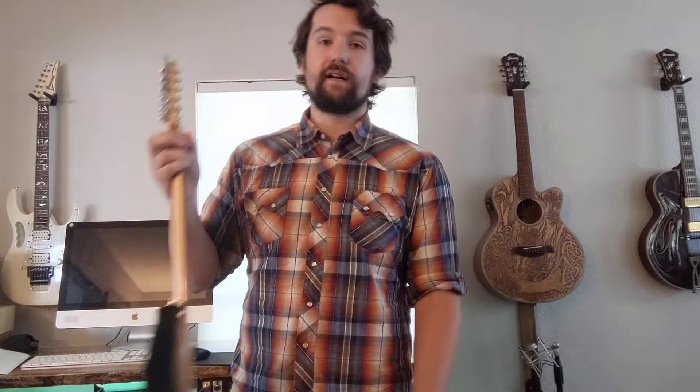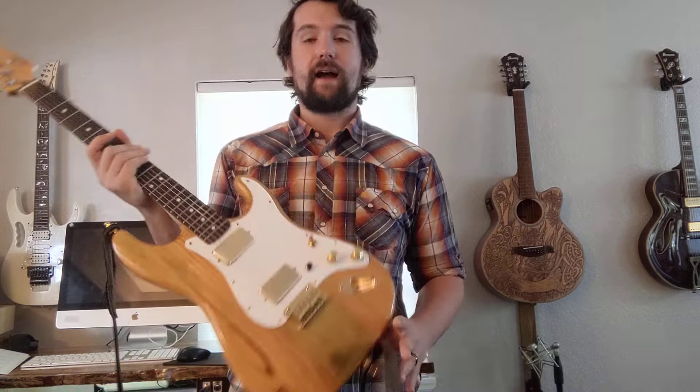After the oil is done and you're positive that it's dry, I do think it's important to do a coat of aerosol shellac. You can get shellac in little spray cans at these stores, and it's nice because it dries really quickly. Just spray it over the guitar using the technique from the last bonus video, and that'll give you a nice coat that seals in the oil. It's a fail-safe barrier coat between the oil and the high gloss coat at the end. That's actually what's on this guitar — I stopped at that shellac coat. It's got a nice smooth coat, feels good, and is natural-feeling with the wood.